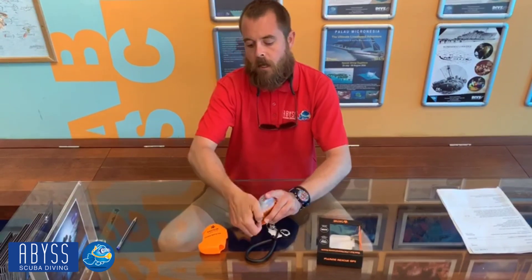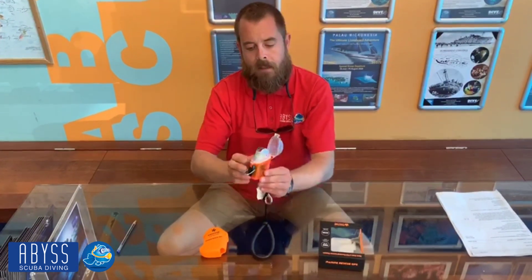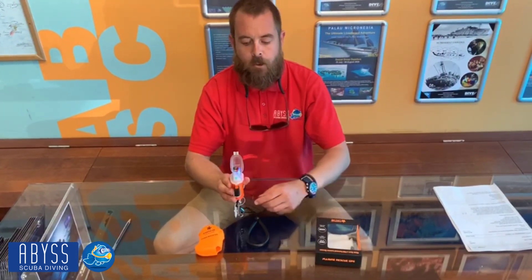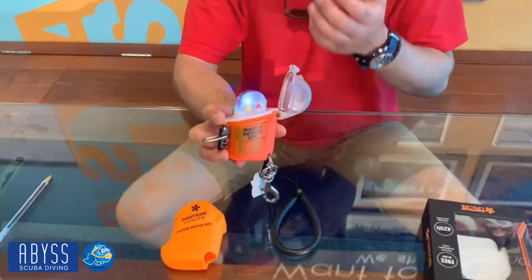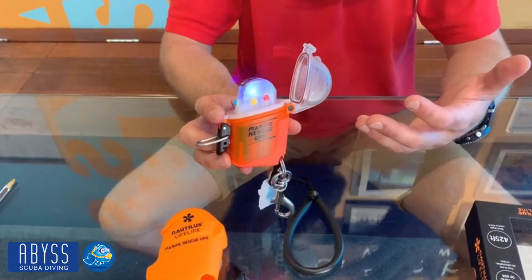So we always deploy this at the surface — it's not to be opened underwater. The clasp is here, designed just to be pulled up, and as I do that I release the internal mechanism. The important buttons, both yellow and red, are not exposed, so I can't press them by accident. The initialization button is here — the blue one. I simply press it once, and you'll notice that a blue LED will then light up. As the LED starts to flash, it will let you know that it is ready to be configured.